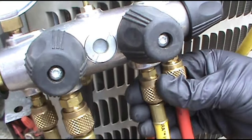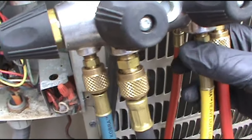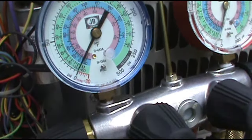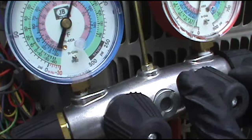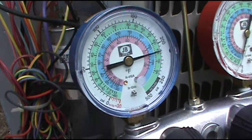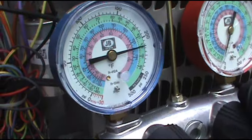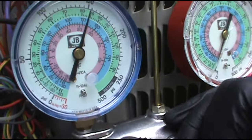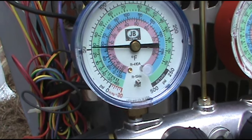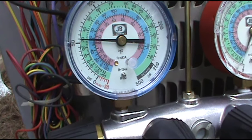This is a heat pump and it's the end of the day, so I'm not going to be able to fix the leak tonight. I'm just gonna do the old gas-and-go until I can come back and do a proper leak check. To get them going again I'll just fill it up — that'll kick the unit on. There it goes — probably a little delay, there she goes.